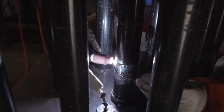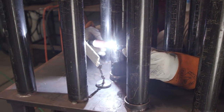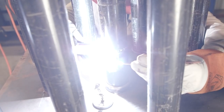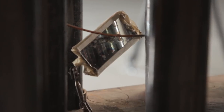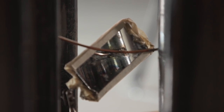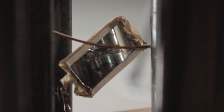For instance, when you shave, you're just shaving the same way, you're traveling up, and you're just using the mirror to let you know to move a little bit more to the right, if that makes sense. But man, it takes some time. It just takes training your mind to know that you're using the mirror so everything's opposite. So the best thing I could tell you is just move your hand the same way. If you want to learn how to weld with the mirror, I suggest trying something easy like welding stick vertical. So all you have to do is move left and right and you'll be watching the mirror as you're traveling up.